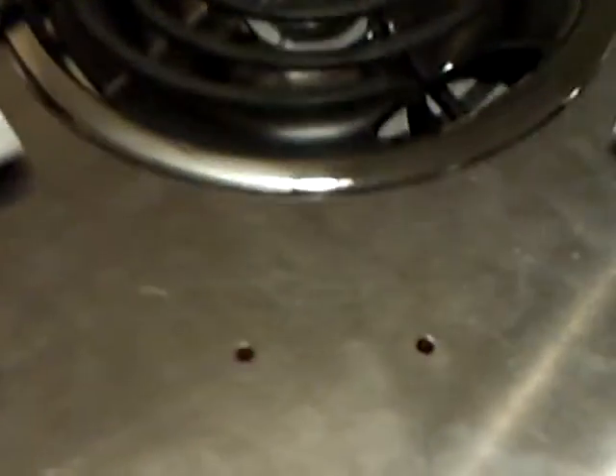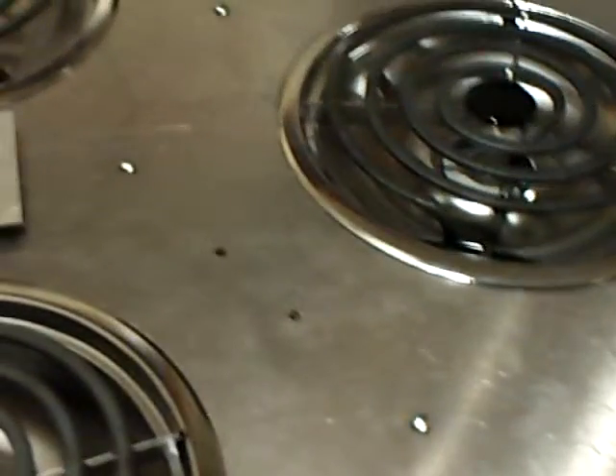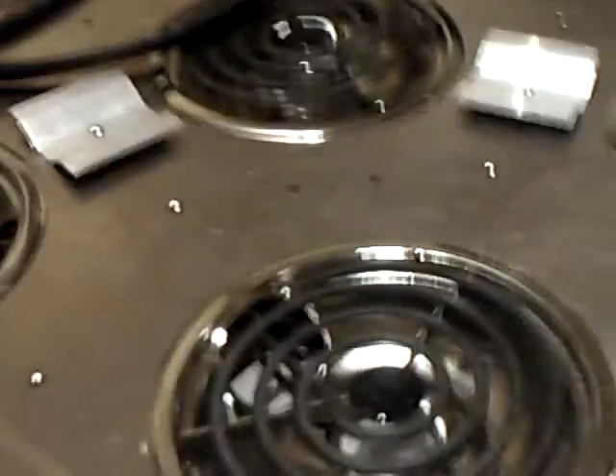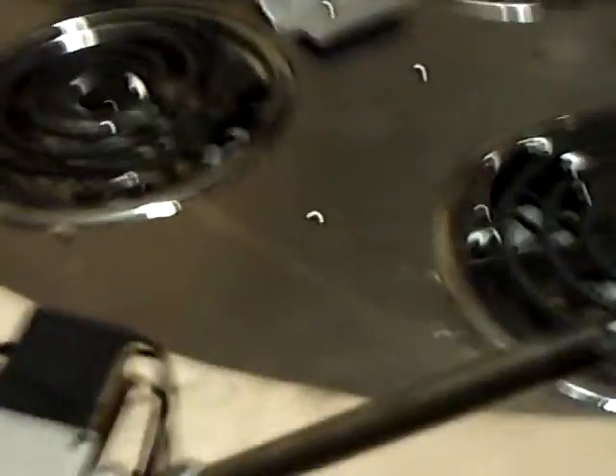That actually acted as a nice voltage divider to provide my LED voltage. I got six LEDs — there's two of them right there, two over there, and another two over there. There's my pressure regulator. I had to use a propane pressure regulator because I needed low PSI — it provides a little less than half a PSI, which ends up to damn near half a ton of force pushing on the polycarbonate. This is my blow-off solenoid — a 12-volt blow-off solenoid that hasn't been mounted yet.